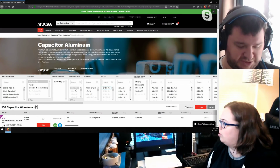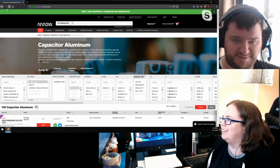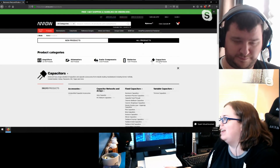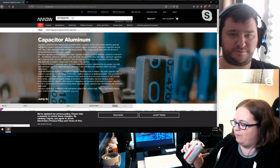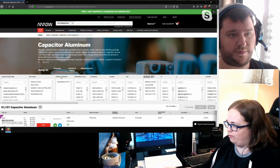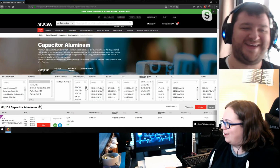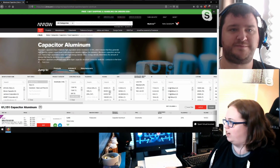Do you just run into crazy shit all the time with your 68K? Yes. Just yes. The problem with the 68K is, I guess the first problem is that you expect the power supply is going to be dead. Then you get that fixed. Then you forget that it does have 30-plus-year-old floppy drives inside. Yes. So I got mine working, and then all of a sudden, randomly, it just stopped working.